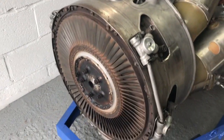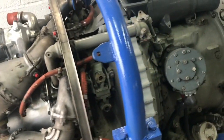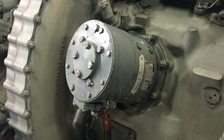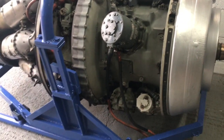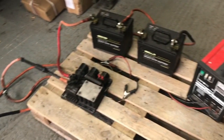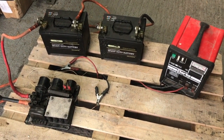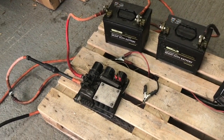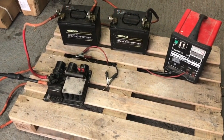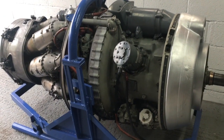So we're going to put some power on, fire it up, see what happens. This is just a dry cycle on the starter motor, which is that point there — you can see it. We've robbed some components out of the Jet Provost to help us do this. We've got a very crude power supply: two 12-volt batteries connected together in series to give us 24 volts and 500 amps, and a Jet Provost starting panel with a relay. So in theory, we've flipped the switch on the start panel and we should get some magic happening inside the engine. Let's flip the switch and see what happens.